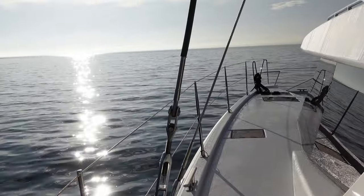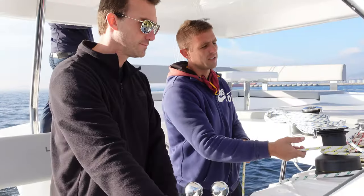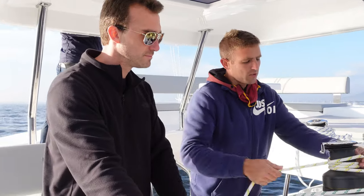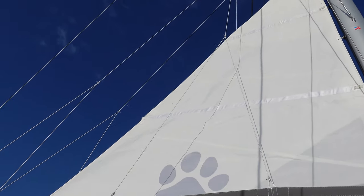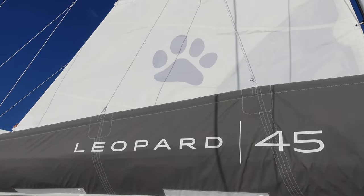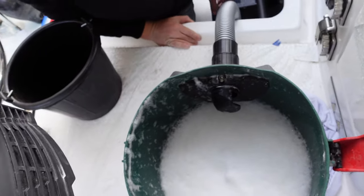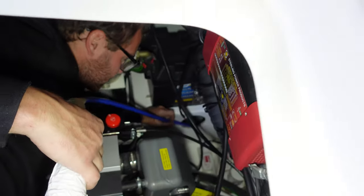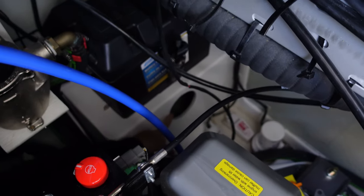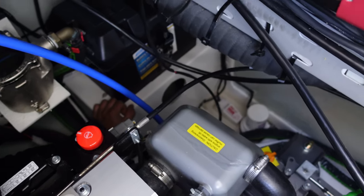This is the sea trial of the yacht we call Liger. A lot happened that day, one event of which damaged the sail drive gears. But even this isn't far enough back to explain the multi-month-long fiasco of arse covering and blame ping pong. This story isn't even fully explained by the 27 litres of salt water that came out from between the engine mount module and bottom of the hull around the sail drive joint, which was so full that it always made sure there was a little water sloshing around in the engine bay.